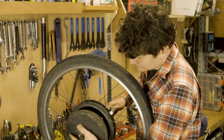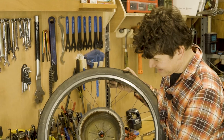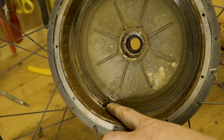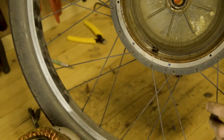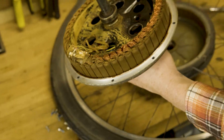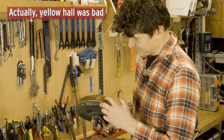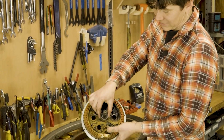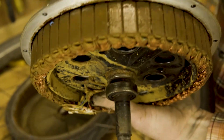Yeah, look at this. We had the water we were expecting in there — totally rusted set of laminations. But more interestingly, if you look closer you can see that the side plate is all scraped up and there are bits of metal that have been bouncing around in here. This looks to be part of the ball bearing cage, and you can see a loose ball from a ball bearing inside here. Amazingly, this motor has been running with sharp ragged metal scraping on the insides, and that didn't stop it from running — these direct drive motors can really put up with quite a bit.